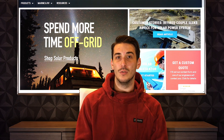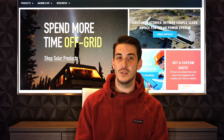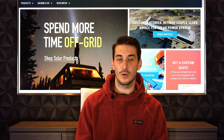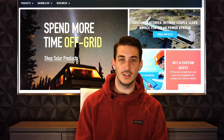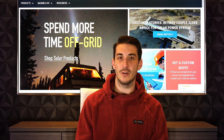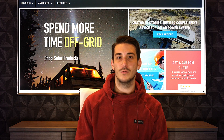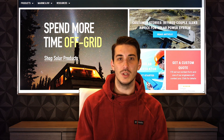When the grid goes down and you lose grid power, that mode of operation changes completely. In that scenario, we're no longer feeding any of the loads on the mains panel, we're no longer selling any excess energy back to the grid, and now your system is contained to just the loads on your sub-panel or critical loads panel. During a grid outage, the battery-based inverter is still producing power given that it's connected to the batteries, so it's sending power to your critical loads panel. Your grid-tie inverter sees that voltage and frequency from the battery inverter and is almost tricked into thinking the grid is still active — the battery-based inverter fools the grid-tie inverter into thinking the grid's still up, and that's how your solar array continues to produce and cover your loads and maintain the batteries.